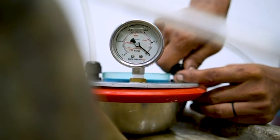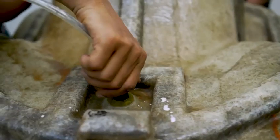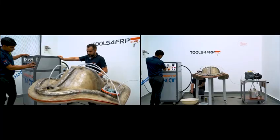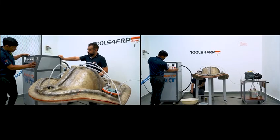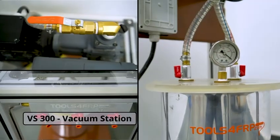This is for air extraction and pulling resin through the actual part area. The second connection is at the flange areas for closing the mold and keeping it in the closed position throughout the process. VS300 model from our range of vacuum stations is being used.